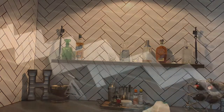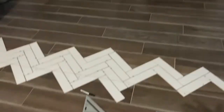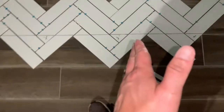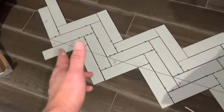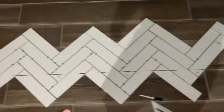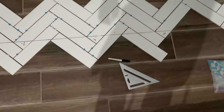When doing herringbone, the best way to go about it is to get a template going. Since I have such a tall area — just like you would with a shower — I'm working from the ground up. The first thing I did was measure where the middle was, then did a template dry run all the way over each side. You can see my marks where my edges should be. Then I marked a line at the bottom and started fitting in pieces.